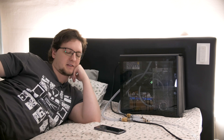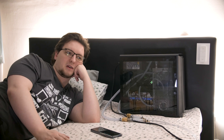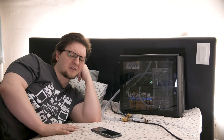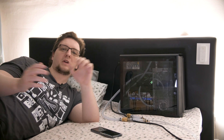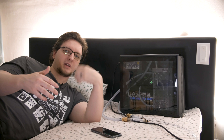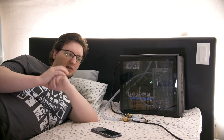One of the nice things about having the temperature sensor is that I can actually monitor how quickly it is heating up. It's taking probably about 10 minutes to do 2 degrees Celsius, which isn't ideal — although it's currently at 20.7 degrees Celsius and we only really want this to be a few degrees warmer than the room itself. It just needs to be not freezing cold when we get into it. I think there's still a lot more on the automation side to do — I'll probably be using Node-RED to set temperature set points and have it automatically turn on at, say, 5pm so that it's warm when we get into bed. It's actually just jumped up to 22.5 degrees — wonderful. I'm reasonably happy with it.